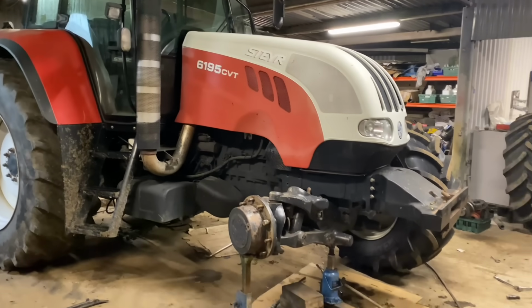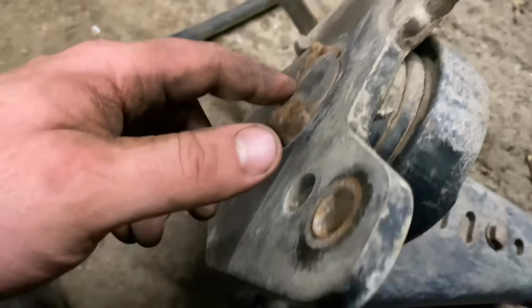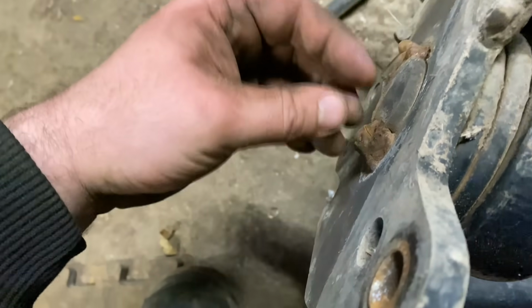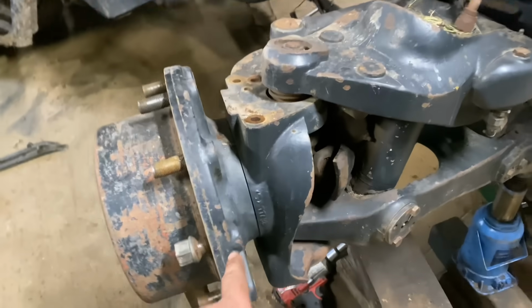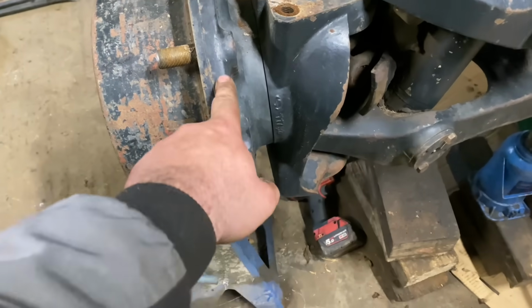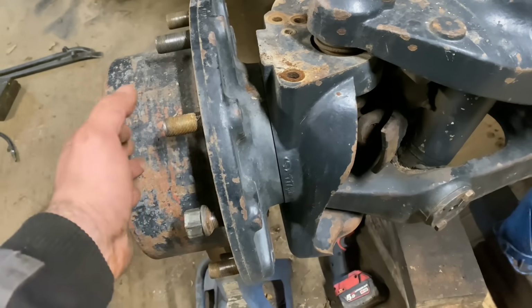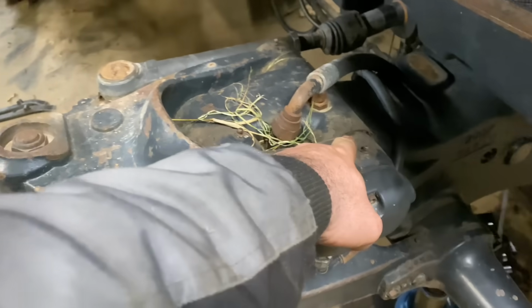So I have the front mudguard off. There's a pivot front fender, but it's been through a lot. It's been welded here, and it's been welded here, and the bearing is bad in it, so I need to rip it up, do the bearing on it, and see what's going on with the shaft, why it was welded so badly. I was trying to beat the wheel studs off as well, and they're pretty well welded in there, so I'm going to have to come up with another idea, then send them all away to be zinc plated in the silver colour. We'll rip off our top wishbone and do the bushing on him.